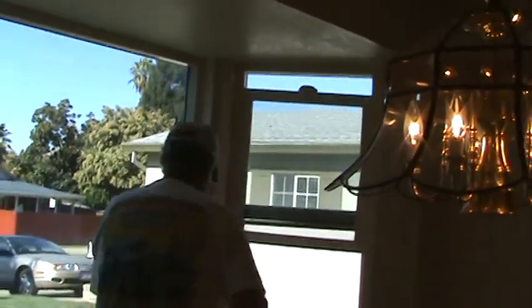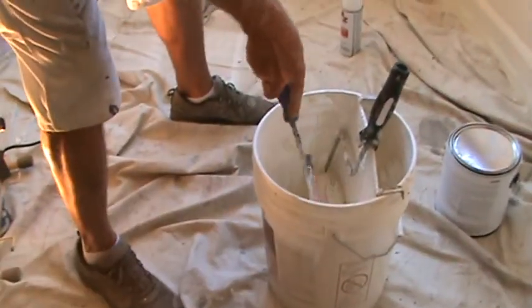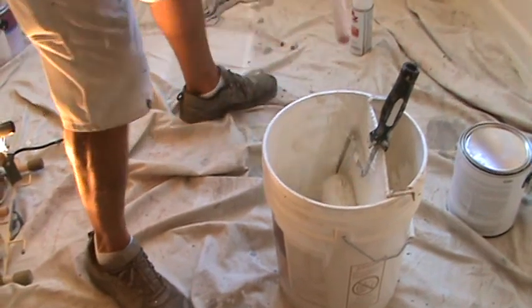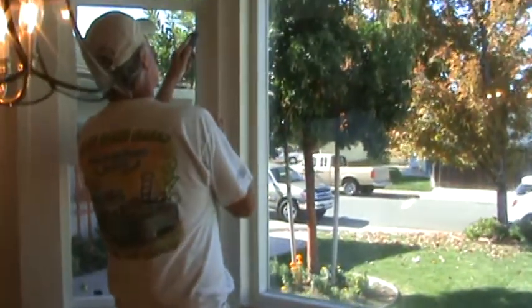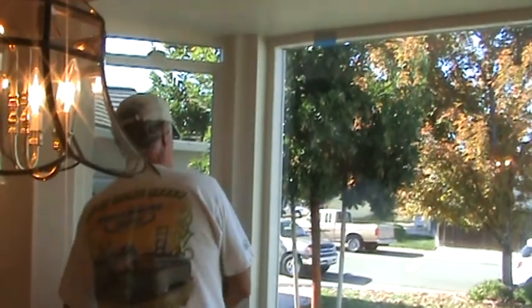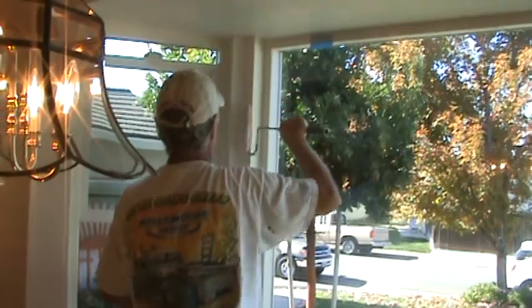You can really dial it in nicely because everything is exposed. You get the light on it, and then you do your bead of caulking, which is usually your final step on painting around a window sill — around areas where maybe they didn't get too close, or there's a little gap, or the age of the windows has caused the caulking to shrink up. So it's just a small solution to run a small bead along there and make it a real nice finished look.